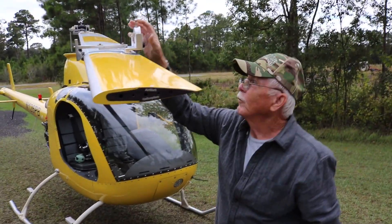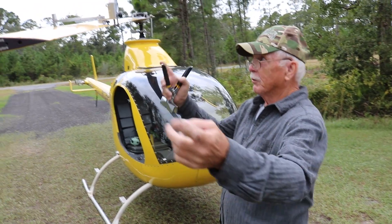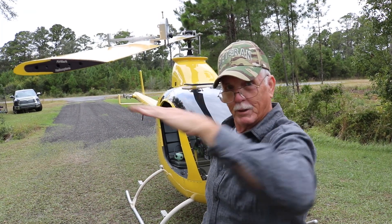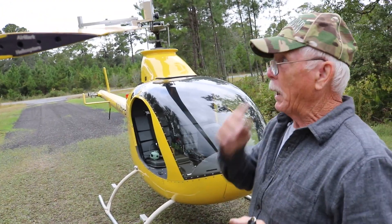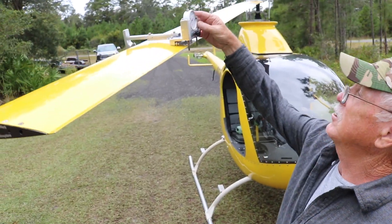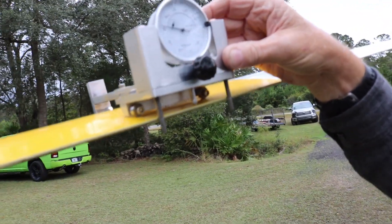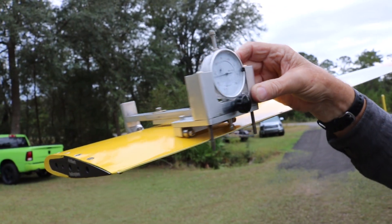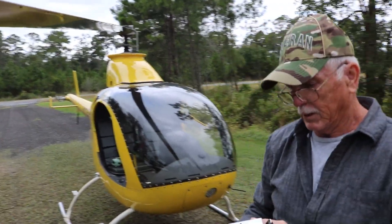Right now the collective takes a lot of pressure to hold up, so we do the first five panels of each blade — we tilt them up. It's like a control surface on the blade that makes it fly up, so it picks that pressure up. We're doing a rough adjustment now. We did a couple yesterday and I'm putting another ten thousandths on it right now. We've got a little gauge here and we're roughly at 30. The tip won't stay there usually — it just goes away. We're going to try this and may end up doing it again.